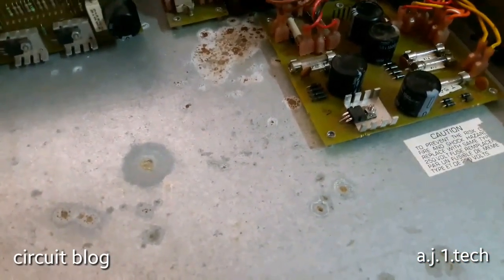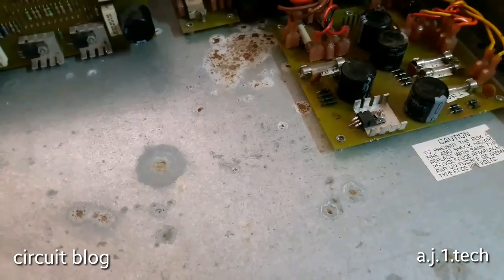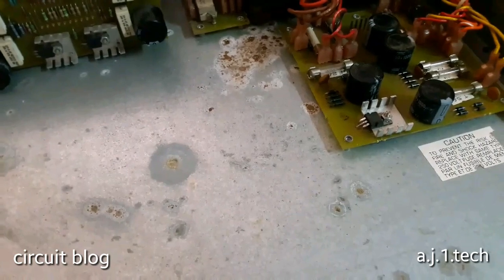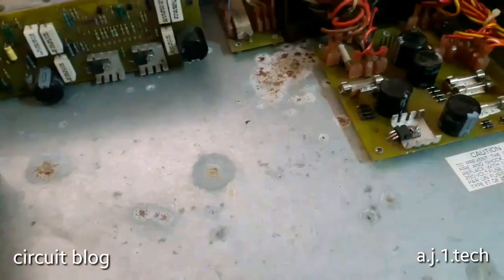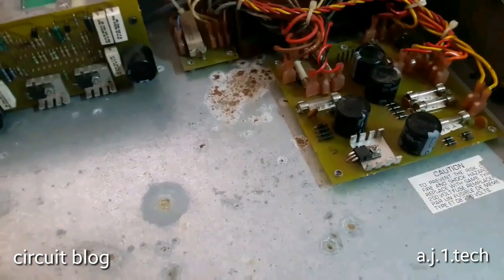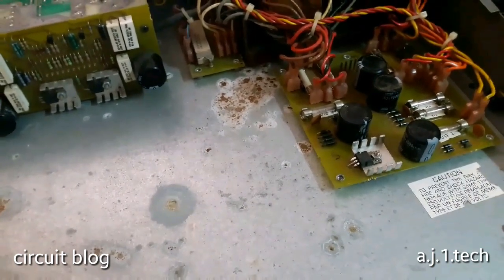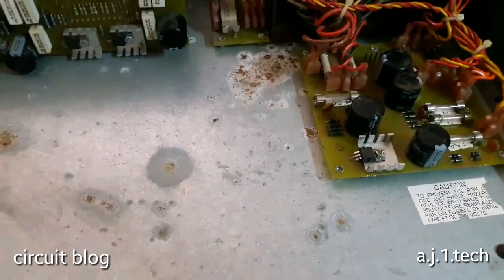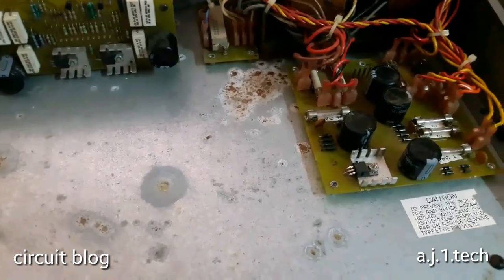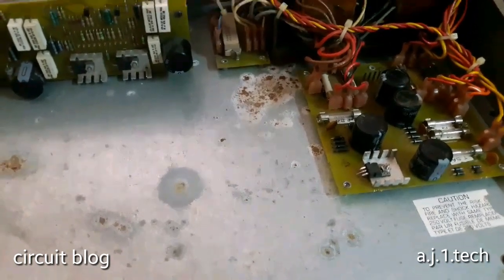Now I'm going to bring the schematic and see if there is a schematic for this device and study it thoroughly before I disassemble this board. I'm not going to mount the fuses and replace the fuses and hope for the circuit to work, because I have seen it in many cases. I replaced the fuses and that increased the burn or increased the short or increased the damage. So I'm going to do that and I will be back.